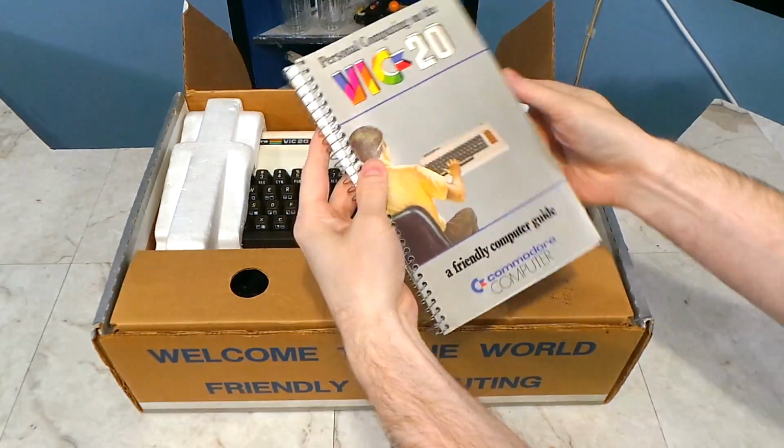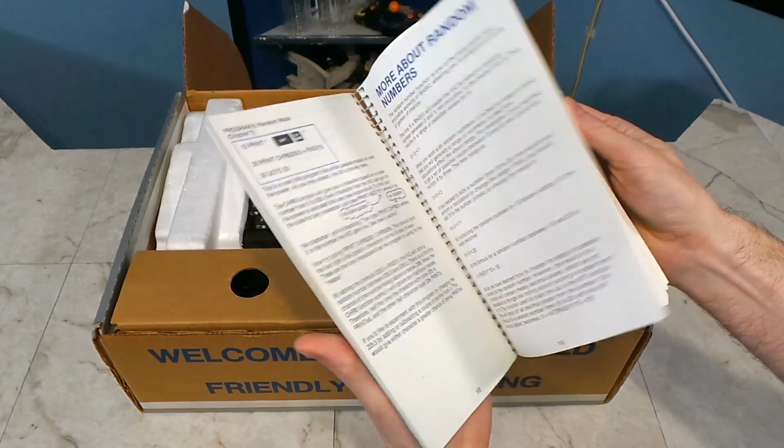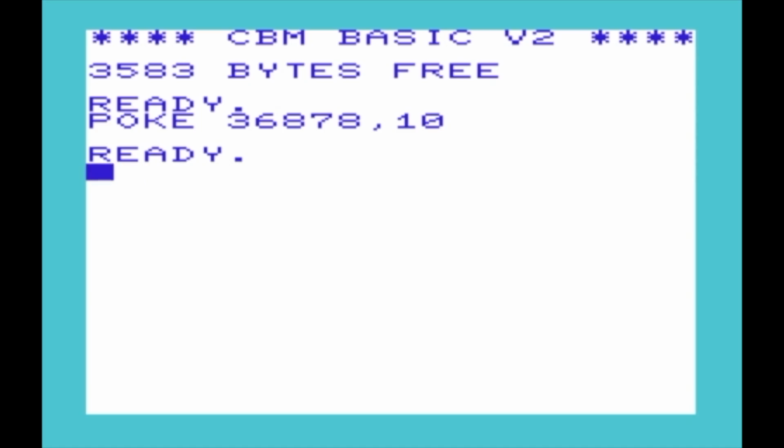Now, let's talk about sound chips for a moment. This was a really difficult decision because I wanted a chip that was still in production and that would interface with a 6502 processor and was easy to program for. What I mean by easy to program is, if you look at the Commodore VIC-20, which is the computer I learned to program on, I could simply poke a value to one of the 4 sound generators and immediately get sound.